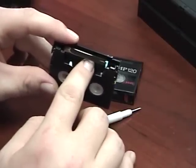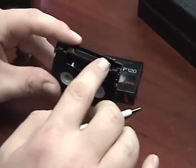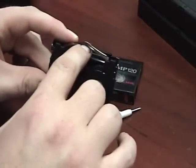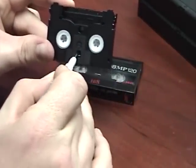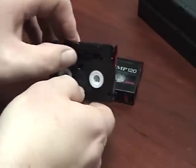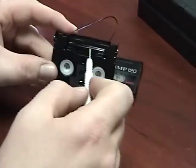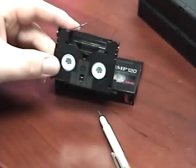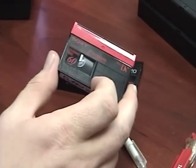What usually happens is a tape has been jammed in a camcorder, and they rip the tape out and it stretches or breaks. You don't have to open up the case if it's broken and both ends are revealed — you just have to get them out of there. The tape is locked, but there's a release in the same area as a VHS tape, though it's not a button. You push down, and I'm pushing a release down and holding that with my thumb. That allows the tape to be released so it comes out of the cassette freely. Press down on the release, pull each side out to give yourself some tape to work with, scotch tape them back together, and then simply wind the tape back up. The tape is practically as good as new again.